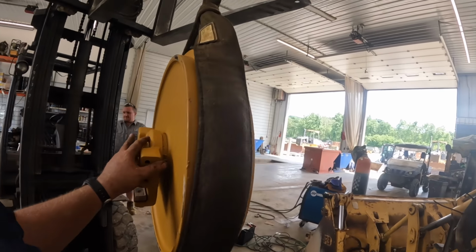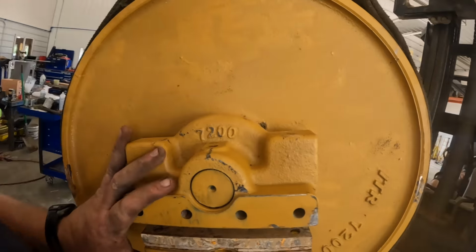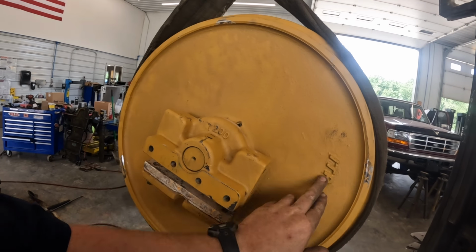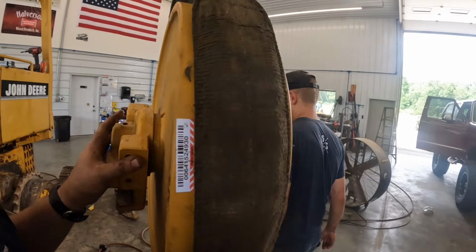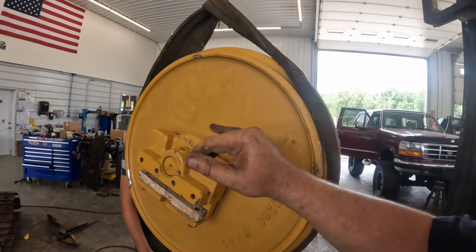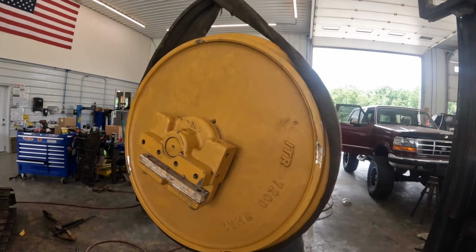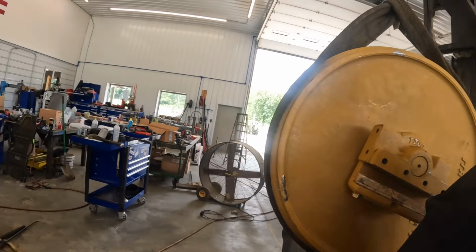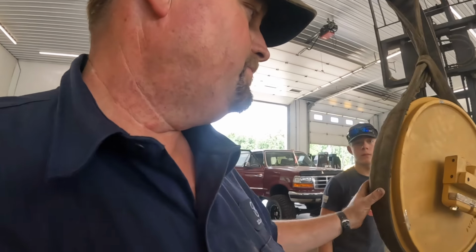One thing you want to watch on these too, I may have explained this before, there's an oil fill plug on these things. You guys ever want to put more oil on them, always put the writing out on these, because this side here, they don't have that plug. So you stick this writing out most of the time, it's the right way out. You can put them on either way, but that'll help you out if you need to put some more oil in the future. You ready?